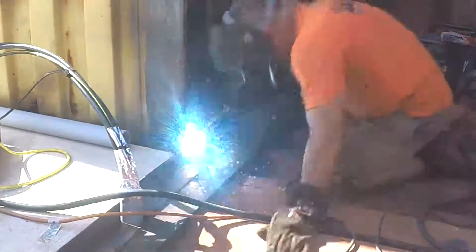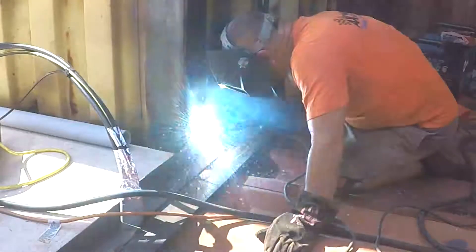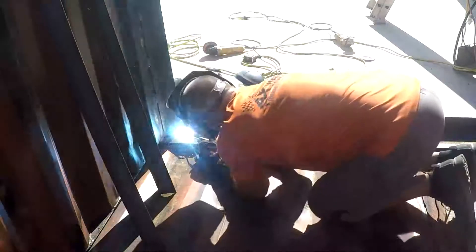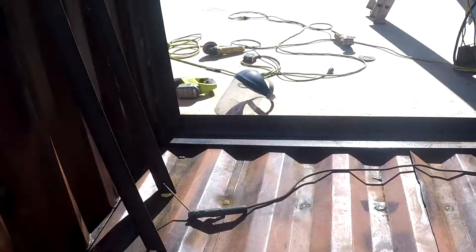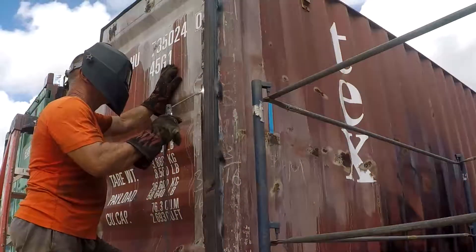This is where the concrete is going to be poured as well, so no wall is going to be added to the right of me. Where the wires are, it's going to be a kind of two-story wall. We're going to leave one section out so we can have the power wires going from the other side of the building — or we'll make a small hole for the cables. Right in front of me will be left open for access to the floor. Once we finish both walls on either side, we'll cut two access doors in the container on my left so we can get between the living room and the inside of the containers. Once the roof is on, we'll cut out all the main walls and be ready to do the concrete work.